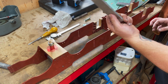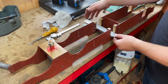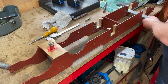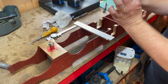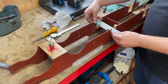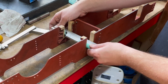This is about 5 thou over the one and a quarter inches it's meant to be, and you can see it's a nice fit going straight through - no problems there. I've also used some bits of shim, I think these are between 6th and 8th thou, and I can put them around the bar and the bar still fits in and can move.